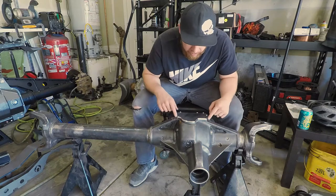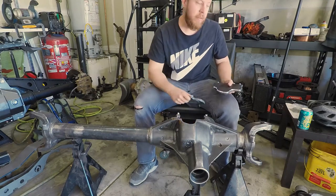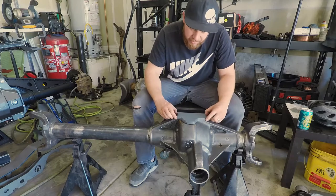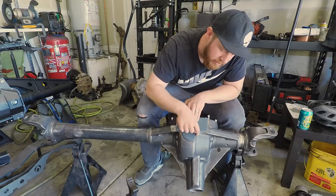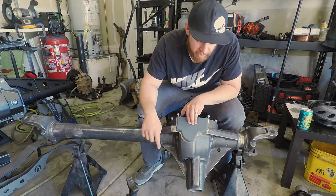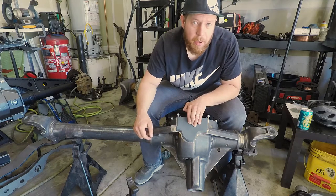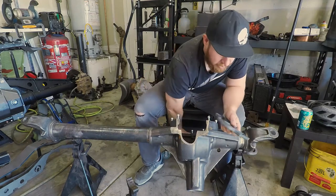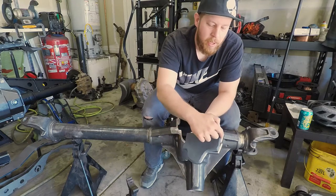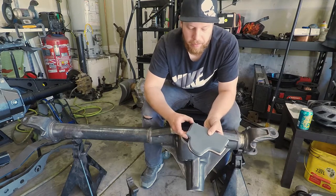The bottom plate fits okay, but you can see it gets tight here and overlaps in a couple of spaces. I worked with the guy from Ballistic on actually making a bottom cover, and I did all the CAD work behind it - that's what I do for a living, engineering. So you can see right away that this one is a much better fit all around. The deal was he was going to send me a bottom plate cut to this size, but he still doesn't have one for me, so I'm just going to modify this one to fit. My job now is to mark up this existing bottom plate wherever it overhangs and trim it down.